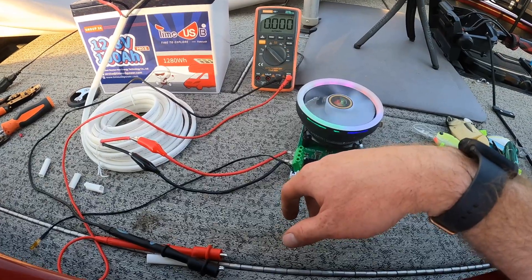We're going to do this quick video explaining voltage drop. This comes up all the time when people are extending wires to run their graphs and they see 18 gauge or whatever coming out of the graph. They want to extend it to the back of their boat and wonder why they can't just use 18 gauge. Because you're carrying that load against a longer length, you need thicker gauge wire to carry that load without dropping that voltage off.